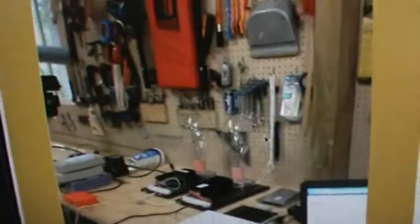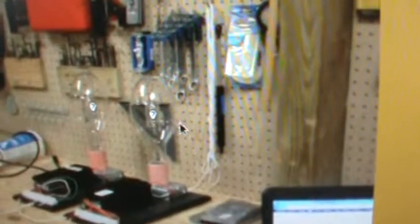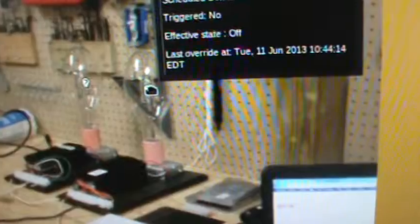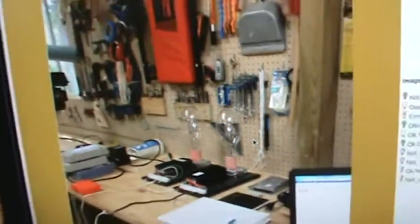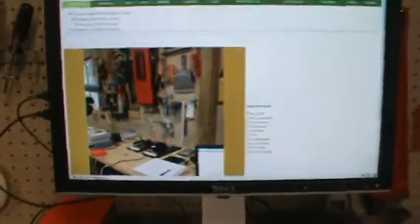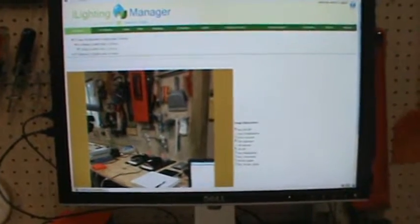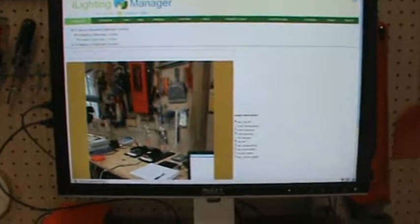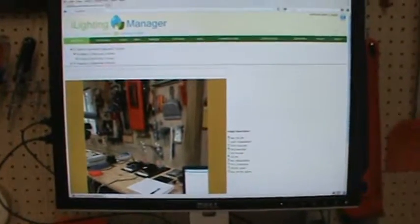And like I said, I've sat here and watched this for 15 or 20 minutes, and I've seen this light number 5, which is the first one in this photograph. I saw it light up green, but we did get a command through, but I'm not able to control it, and the communications are very, very sporadic, and I think it's a timing issue. I'm not positive, but it looks like they're getting chopped up into bits down on the other end, and then maybe chopped up again coming back through, but they're just not consistent enough for the software to work.